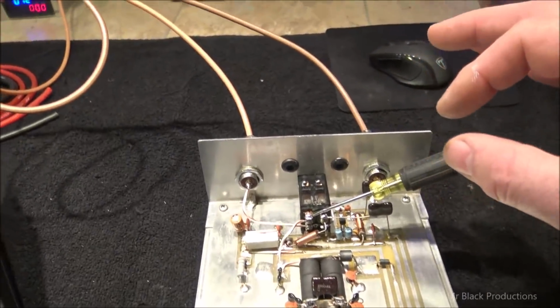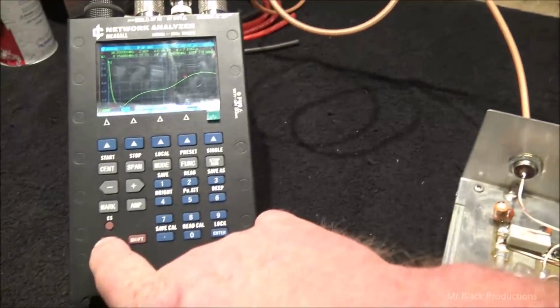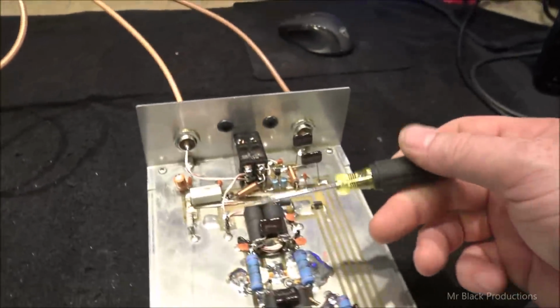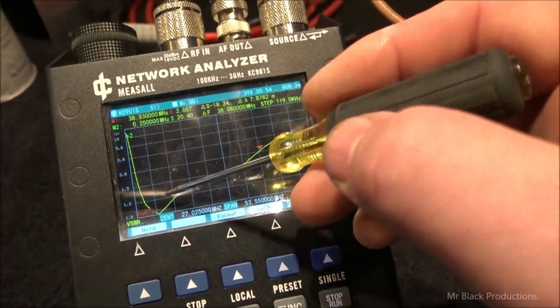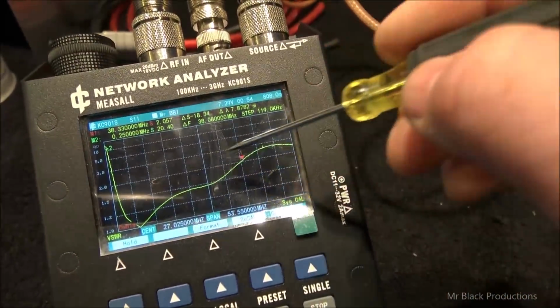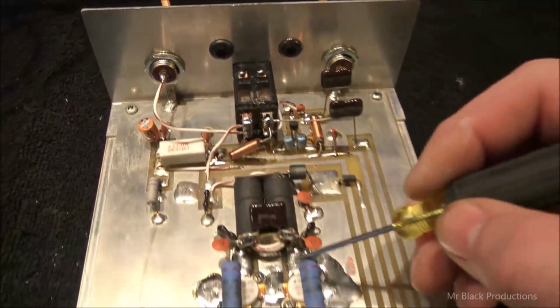Okay? So what we want to do is tune this with either induction and capacitance coupling to ground for the lowest possible SWR pass-through. So, put this on pause. The characteristics being displayed to us, yeah, it's the advantage of having a real piece of test equipment. The characteristics that this is displaying to us is that we've got a large amount of induction already present. But as we're going forward in frequency, as we're increasing or decreasing in frequency, we are running low on capacitance. So, that's interesting.